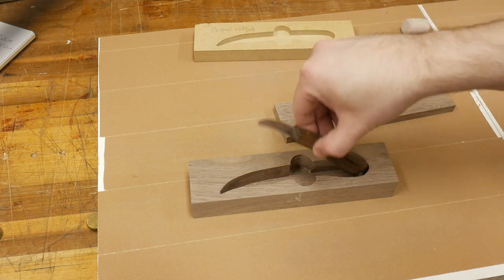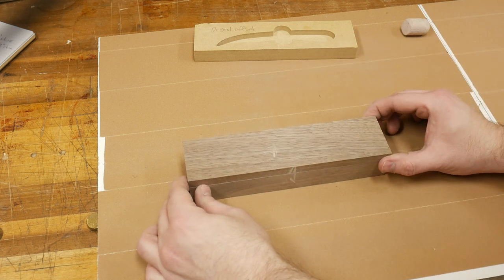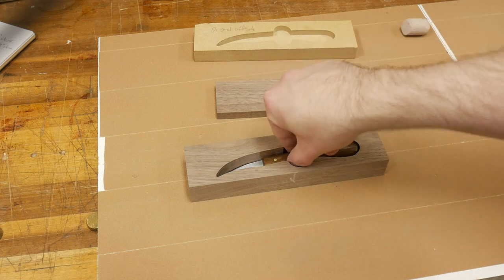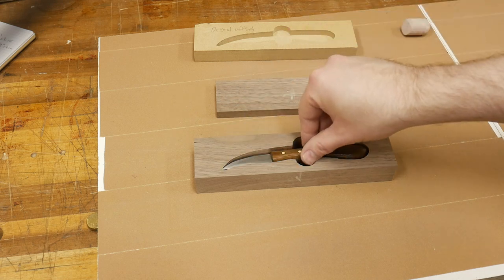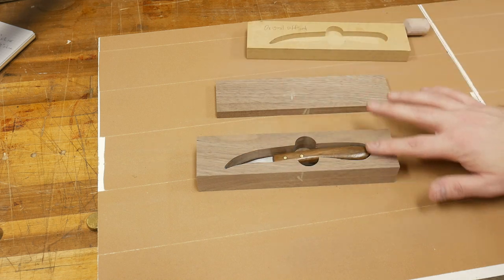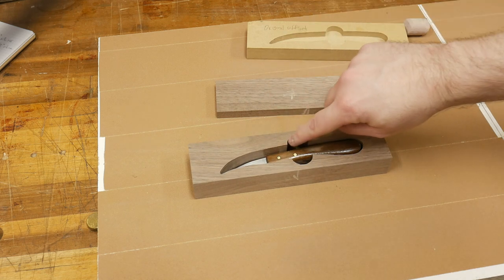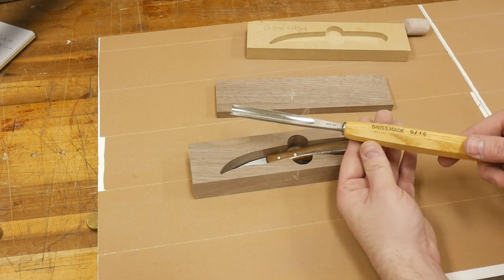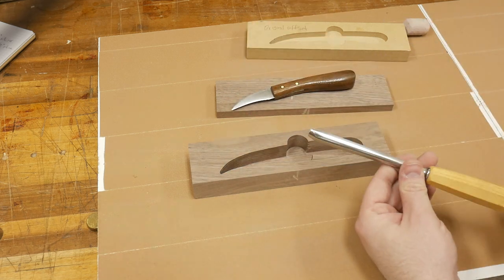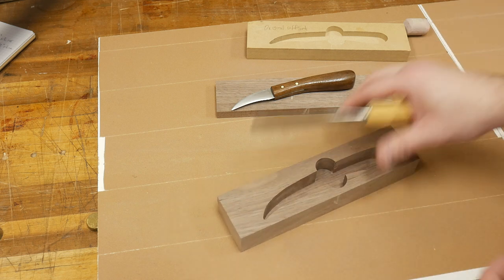Let's see how it fits. I'm going to stick that in there. That's below the surface. Make sure this doesn't hit, and that's good. One thing that I did notice are these finger holes — they're a little sharp. As you can see from my sample piece, they weren't that deep, so I didn't have to stick the fingers in very far, whereas with this being 0.81 or 0.82 deep, my fingers are going down pretty far, so I'm going to have to relieve this edge a little bit with a gouge — a number nine gouge. I've used this probably twice, so don't judge me on my ability to put a chamfer on these edges.